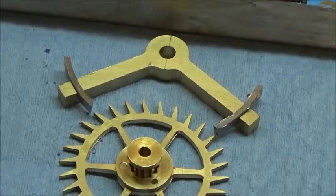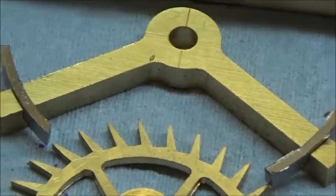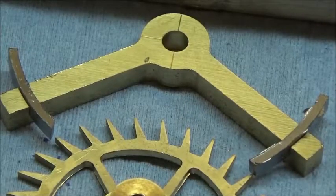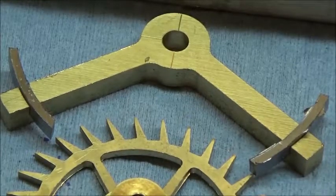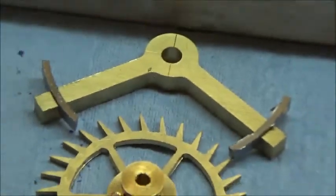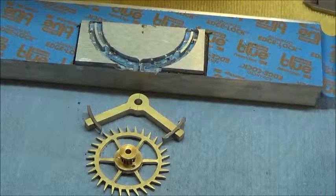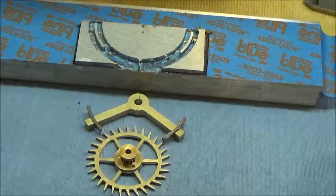Saves me making those things by hand, that's for sure. There's the escape wheel, there's the pallet arm. Now what we've got to do is make some little clamps that go on the pallet arm that hold those nibs in place. The one on the left hand side doesn't even have anything much to clean up. The one on the right just needs a little bit of clean-up work where it tried to cut the tabs and where it broke loose. So I think we're in good shape — I think we accomplished what we needed to accomplish. Unfortunately we had to do it twice, but that's alright. At least I know what the problem was.